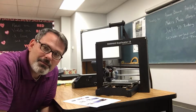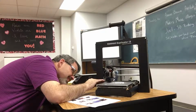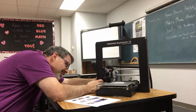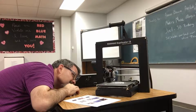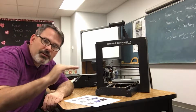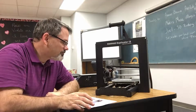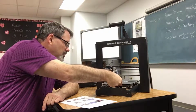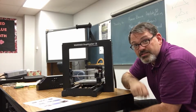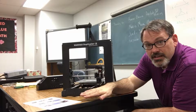And the gap in the middle is now probably up to 3 sheets of paper. And it's touching now on this side. So there it looks like a curve in the platform, about the width of three sheets of paper, maybe a millimeter. I guess I should check the other side. And it does the same thing. So it looks like the platform rises in the center and then falls again on the ends.